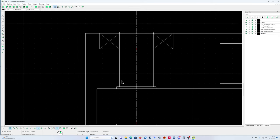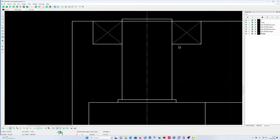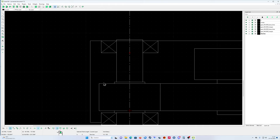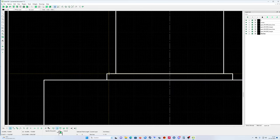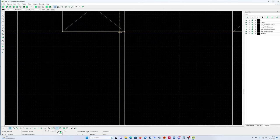And now I see a small problem. And the problem is not so big. Because now the bearing can move over the shaft if it's worn out a little bit, I don't know, but you must always prevent that. So what we're gonna do, we're gonna make the shaft a little bit bigger from here. Wait, from here, yeah, to here, like that.